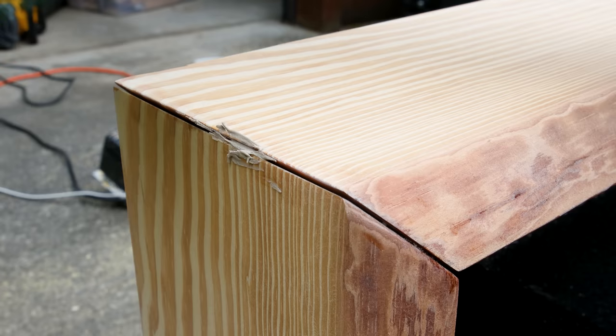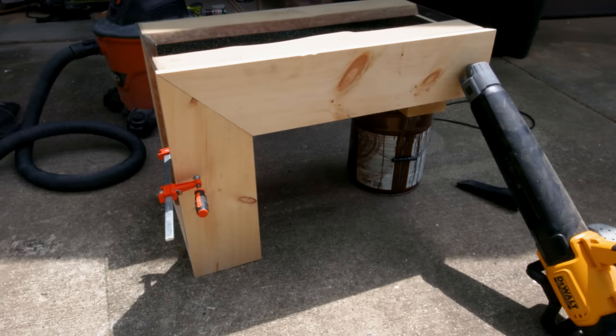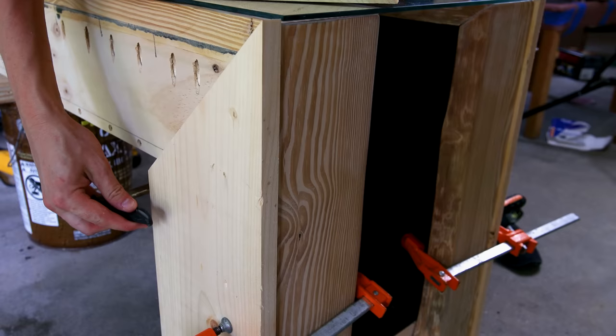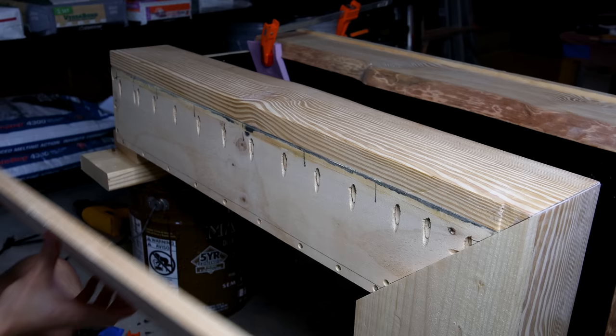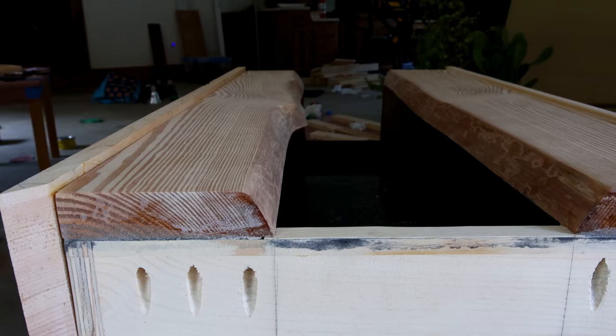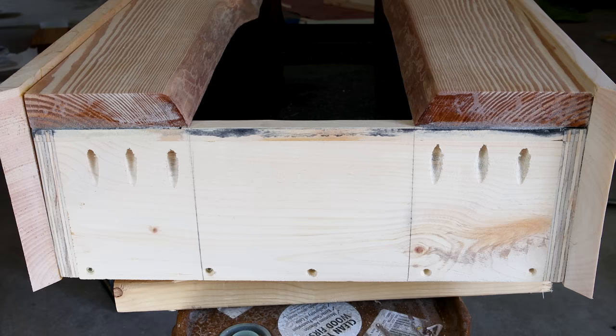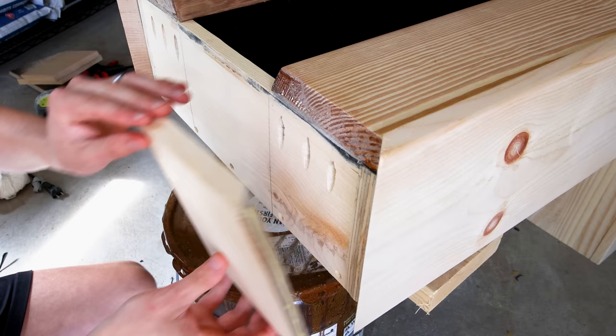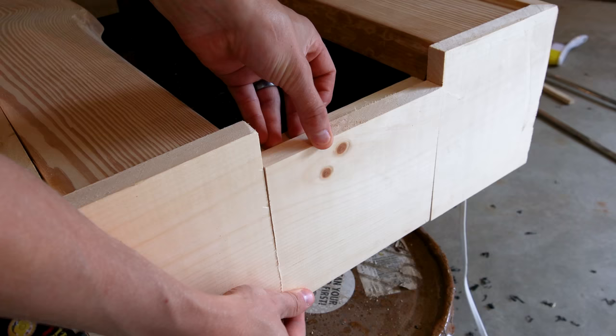Unfortunately, I also had to fill a gap on the waterfall edge. I cut up common boards at an angle that aligned perfectly to the sides of the table. I don't want any visible fasteners, so wood glue and clamps were the obvious solution. However, as I was doing this, I realized I didn't account for something crucial — an access port for the pump's cord. The only spot that made sense was on the back. Luckily, I came up with a great solution: I cut a board into three sections and glued the ends to the table, while the middle piece will instead be removable.